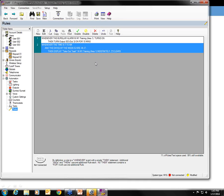Up arrow again, and you're going to get your keypad adjustments. So we right arrow into that menu, and here we can actually change a couple of things. So the tone, and you may be able to hear, as I'm pressing that, how that's changing. That's one thing that you can change. The ELK key acts as a back key when you're in a menu, so now I'm back to that. I want to go up to keypad beep volume, and here I can increase or decrease the volume. And again, ELK once I get it the way I want it, and then you also have your LCD backlight adjustment, and this adjusts the level when it's not at full bright. And so those are the adjustments that you have for the keypad from the keypad.